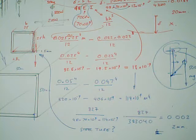that dimension. Now, there is another solution to this, because you do have control, is you change this. You change the E, and you switch to something like steel. And you go back to steel tube, and you go for a smaller dimension. This is that first analysis that says this is the decision I'm making about this particular beam, because once that decision is made, you can then make an effective decision about how big this space is going to be. Now, all of that said, that's not going to change the fundamental question that we started with, which is you've got 500 newtons acting at a distance from the wall.